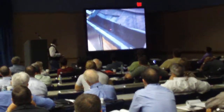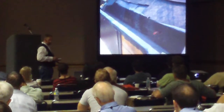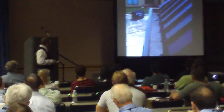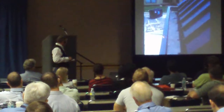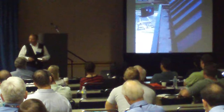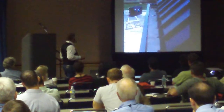Internal built-in gutter detail. It looks kind of crummy in this slide, but it cleans up real nice. This is lined with EPDM rubber and then a pre-finished cap trim that matches the roof panels. And in a northern climate, the black rubber lining helps to keep it thawed and ice-free, so it's a good detail.